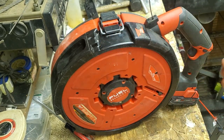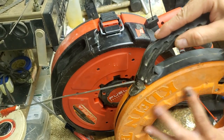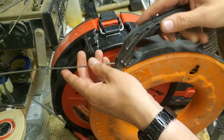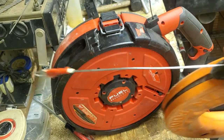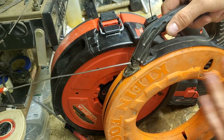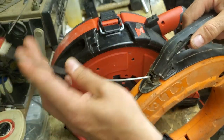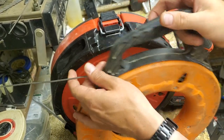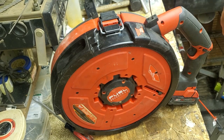The one thing I was concerned about is that a motor is forcing the tape out and forcing it in, and that completely removes the human feel. With a regular fish tape you can feel what's happening inside. Things can happen inside the body where the tape gets twisted or wrapped up on itself. There are certain rules you have to follow — if you pull the tape really tight it cuts down through the middle of the bundle and it's all tangled. With this tool, you can't really feel when it's hung up or what the fish tape is doing, and I think that's a huge disadvantage.